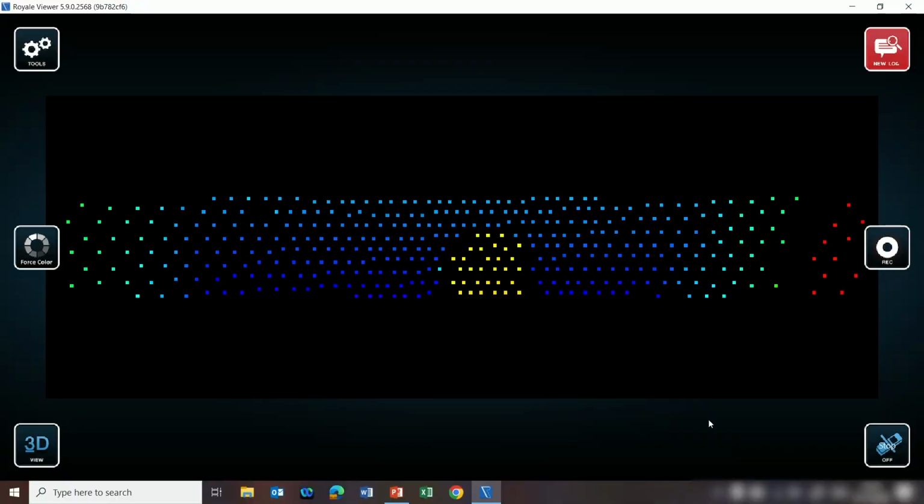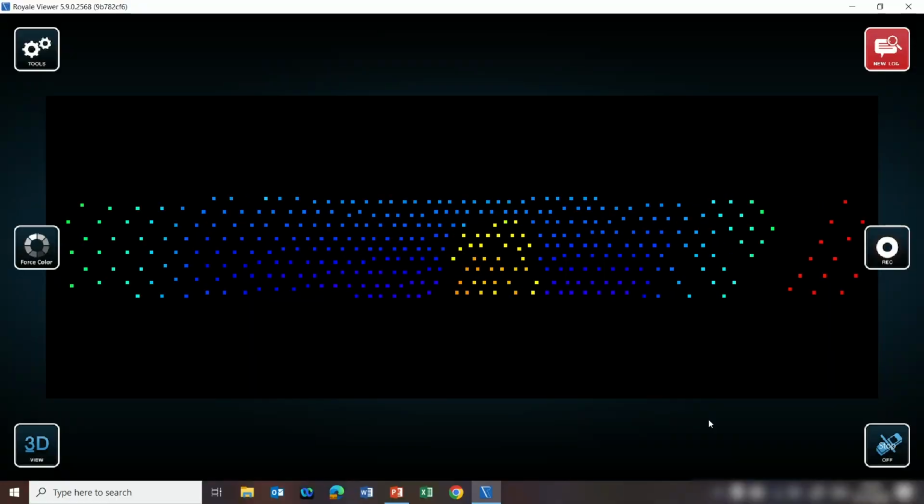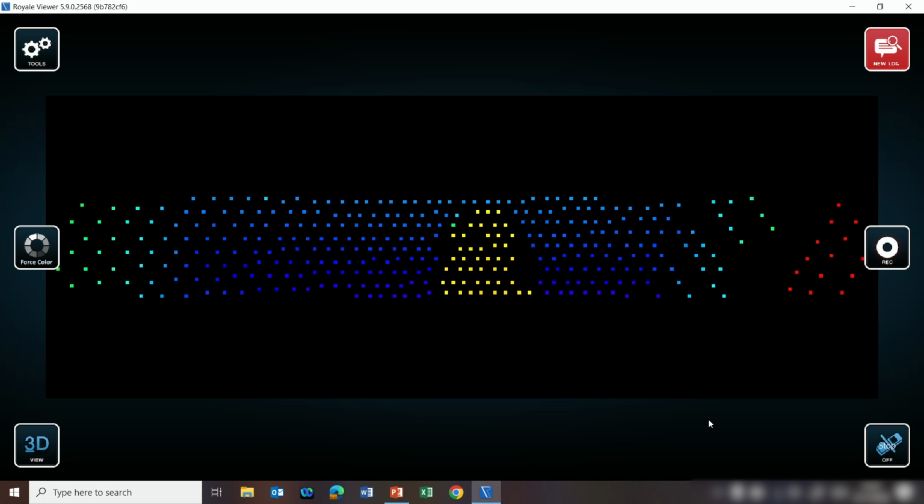Then I'll switch to the other use case. Running at the same time, we have our spot illumination with only 600 individual pixels, but up to 8 meters of range. In a robot, this will be used for mapping and navigation, while the flat illumination will be used for closer obstacle avoidance and object detection.